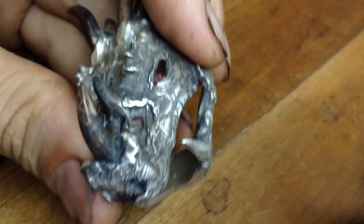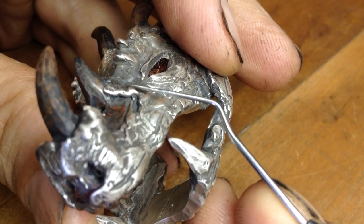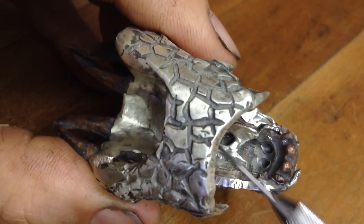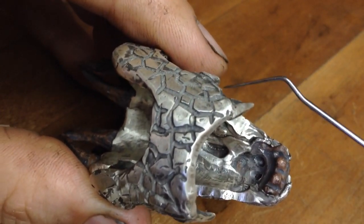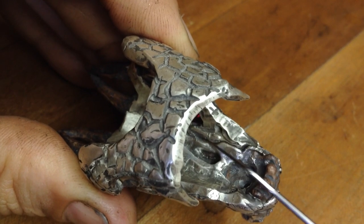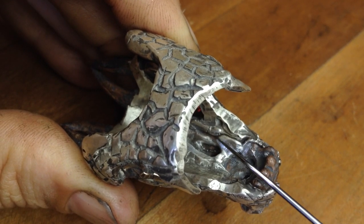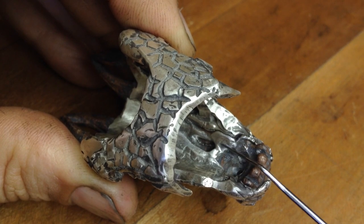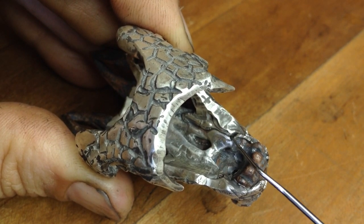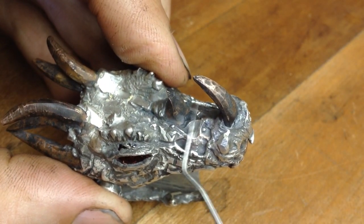The average thickness of the part needs to be uniform across the material and have enough push. When you flip the jaw over, you can see metal flowing from the central sprue and metal flowing through the skull and jaw sprue met at a different rate — the two didn't uniformly bond together. There's actually a section where each side cooled and ran into itself. Based on this line, they had different cooling rates and retracted from one another. More sprues would have been helpful, and we could have thickened up the top of the jawline.